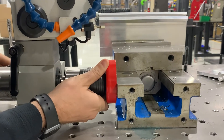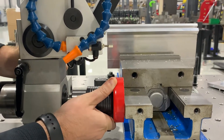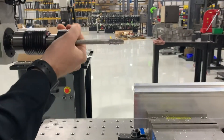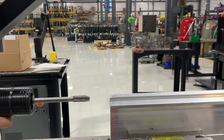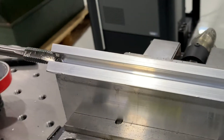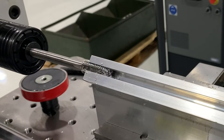I told them to send some parts in so we could run a tap test on the flex arm. The extrusion needs two inches of total thread depth and needs to accept a set screw in the end, so we fixtured the part horizontally and decided to go with the GHM 18 hydraulic unit. This has the multi-positional head, which allows the operator to tap horizontally and easily reach their desired thread depth.